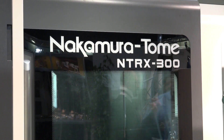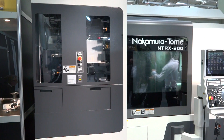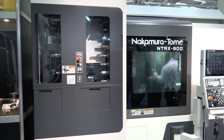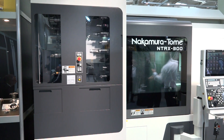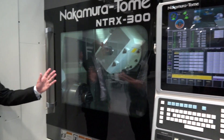This has got two spindles on it, but you can have these with just a single spindle and the B axis. You've got a single main spindle with a tailstock, or we've got the sub spindle, and we can also put a steady on there for larger shaft work. You obviously need to feed this B axis with tools — how many tools in the ATC as standard? Standard is 40, then we've got options to go to 80 and then 120. So we are talking truly multitasking here on turning and milling? It's a full production suite machine. We've got an in-feed and out-feed conveyor so we can take raw billets using the grip on the ATC head, and we can also utilise a bar feed coming through on the main spindle.